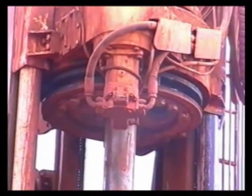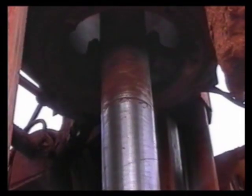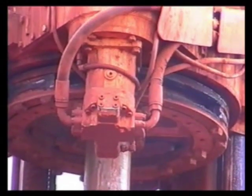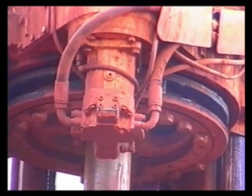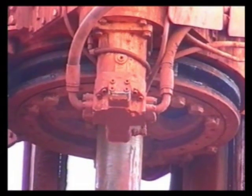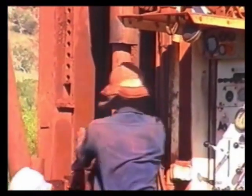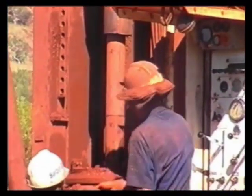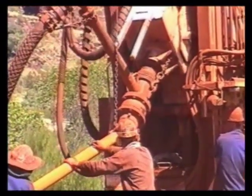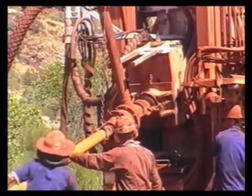The lower drive table at Barber's DR drills, rotates, and drives casing. Unique casing jaws, manufactured from high-strength heat-treated steel, transmit pull-down, pull-back, and rotational forces to the casing. The lower drive can also be used as a breakout tool. The top drive power tilt feature permits semi-automatic loading and unloading of drill pipe and casing.